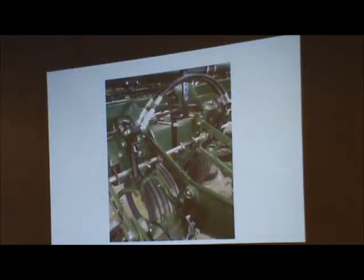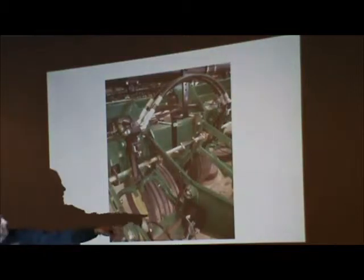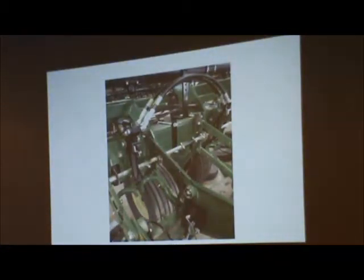How it works: a hydraulic system goes to each row with a hydraulic cylinder that acts and thinks on its own. It's got a weigh pin down in the gauge wheels. Each row has its own weigh pin working within the brain box to make decisions on when to lower and when to raise. It's reading 200 readings per second and has the ability to change three times per second.